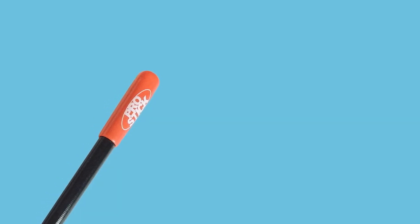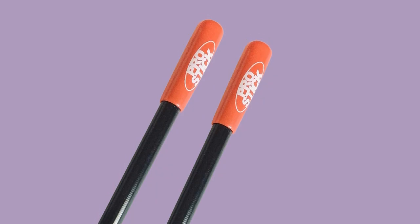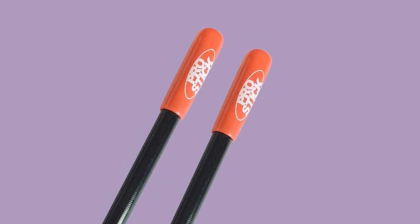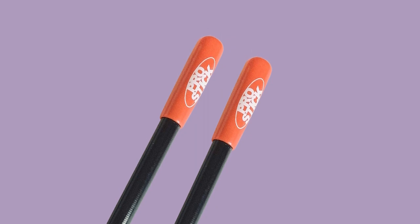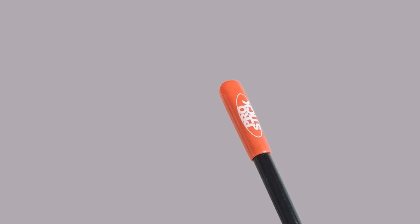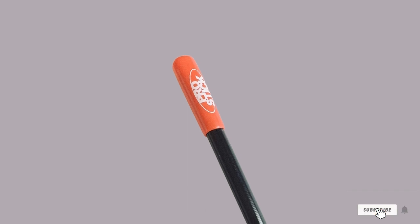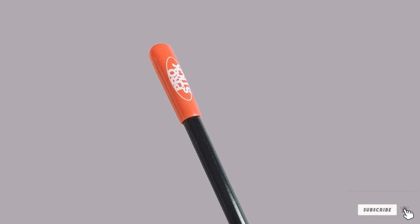The antenna's mast attaches to mounting bases via a nickel-plated brass ferrule. The two are soldered together, then receive an epoxy bond on both the antenna and base's touching surfaces. This top-loaded antenna is tuned at the factory and is not designed for easy tuning by the end user, further simplifying its design and construction. When simplicity is king, the Prostick 4-foot 1000-watt Fiberglass CB Radio Antenna is its scepter.